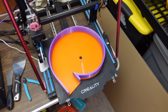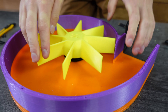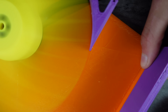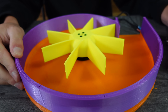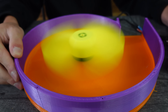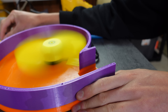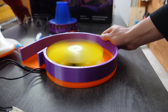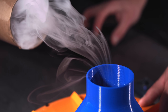Next it was time for the centrifugal snail blower. I printed the giant base housing all in one part, installed the motor, screwed it in place, and put on the impeller. After spinning it up, it seemed to blow pretty well, but there was a loud cavitation noise that I think was being caused by the blades passing super close to a sharp edge. To fix this, I melted the sharp plastic edge and bent it over a little bit — success, that totally worked and it was a lot quieter. However, this blower ended up being too big for the motor, and even at low throttle levels it was pulling way more current than the other two designs, making a fair scientific comparison difficult.